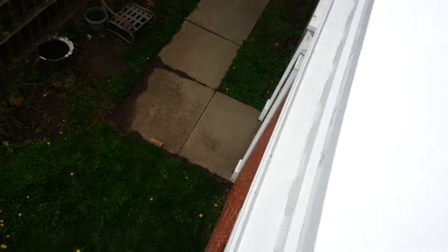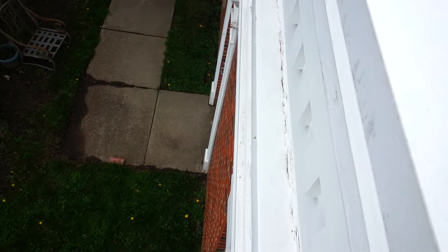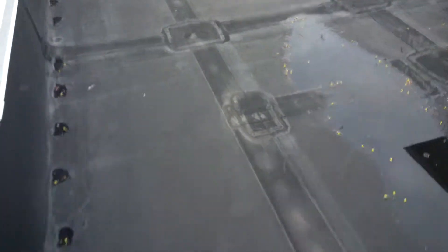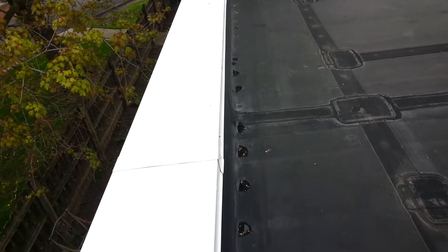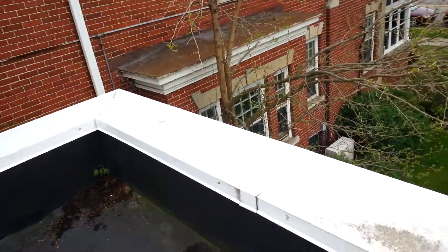There are actually worms inside of this office that I'm above right now. This entranceway where this concrete pad is and that doorway had about five feet of water coming in onto the floor and spreading over into this office. We've got to stop that from happening. The first line of defense is going to be take care of the cap flashing, snake this drain tile out and see if this ground water will go.